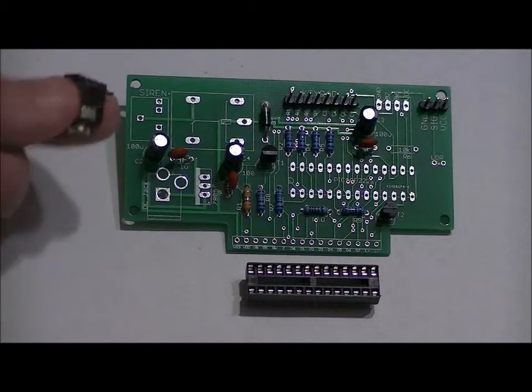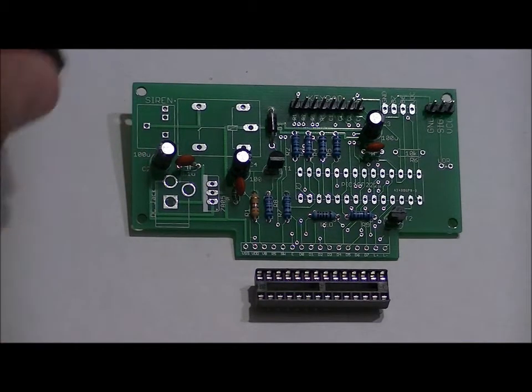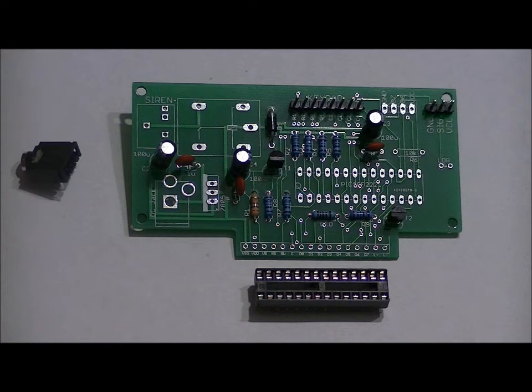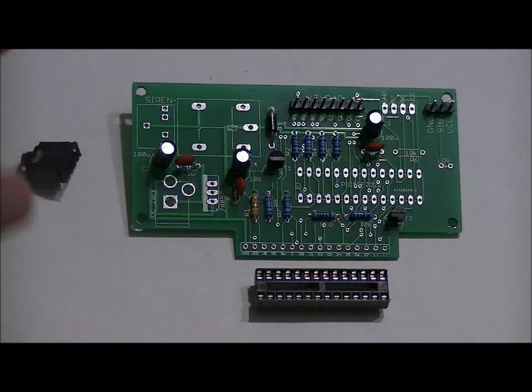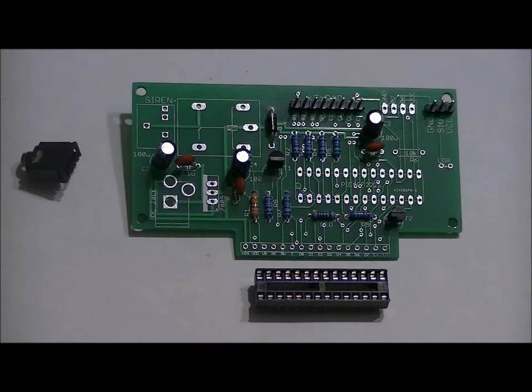The audio connector, which we will connect to our siren, has 4 pins on the back and 1 pin in the front. And it goes right here. It only fits in one way. Make sure that all the pins are lining up with the holes before you place it in. Once placed, it should sit nicely into the board. Hold it down with one finger, turn the board around, and solder this lead right here. Then double check from the top that it's still sitting perfectly flat on the board, and then solder the last 4 pins. It should look very nice after you are finished soldering it.